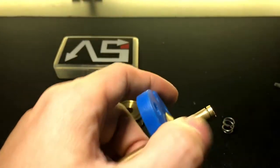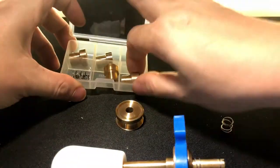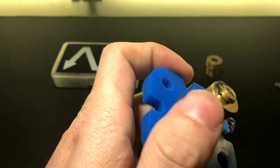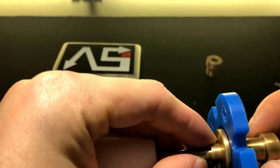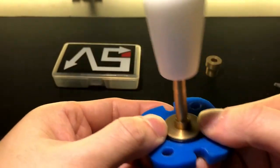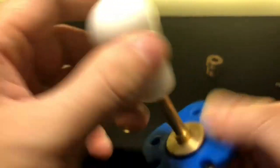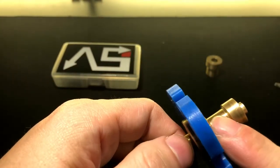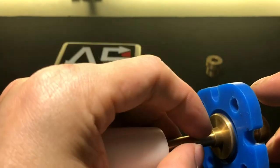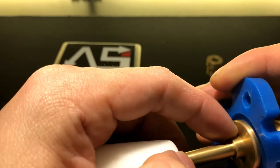Let's use the high tension spring first and try the standard test actuator. The spring eliminates the empty space so there are no moving parts and therefore no wobble. The spring pushes the actuator towards the clip and pushes the core to the shaft. There will be some friction there and we need lubrication.